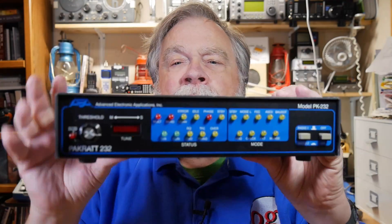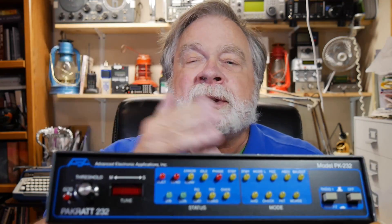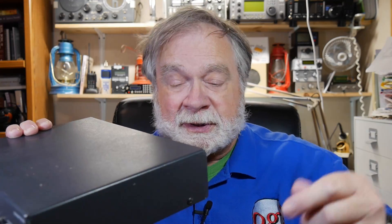On the front it would tell you what mode it was using. The modes on offer were RTTY, AMTOR — which is an error-free form of RTTY that has a very rapid exchange of information with the terminal unit on the other side — PACTOR, which was quite an improvement over AMTOR and which I did a lot of, and also PACKET. It would do Baudot as the RTTY, ASCII code back and forth, and it could also act as a Morse code machine.